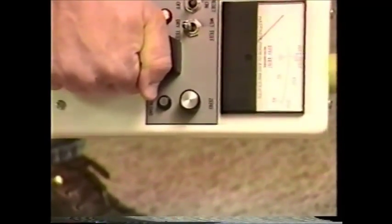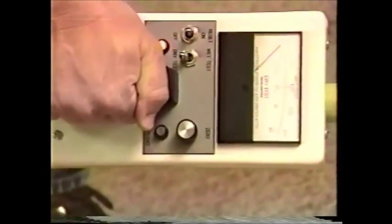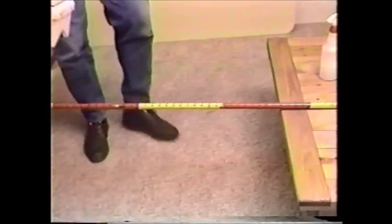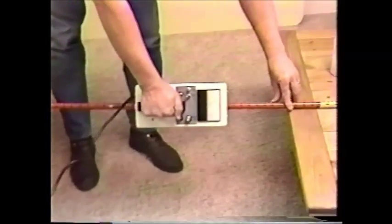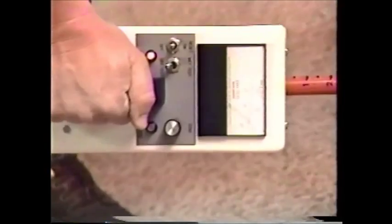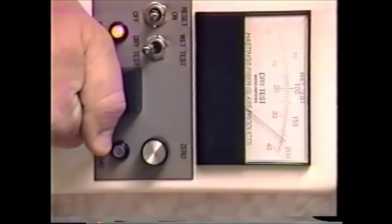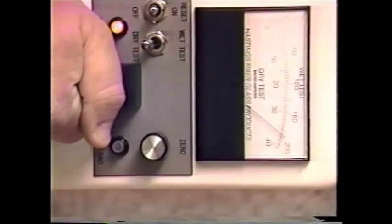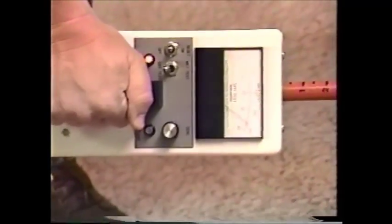The stick being tested has been returned from the field. While it looks contaminated, its dielectric value is still quite good. In this instance, we have created a known defect in the center of the stick. Because we use AC voltage, the meter has the ability to see inside the stick without damaging the stick. Because this stick is measuring below 40 microamps, it may pass the OSHA required wet test.